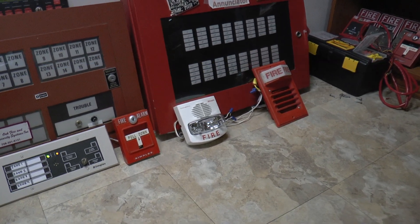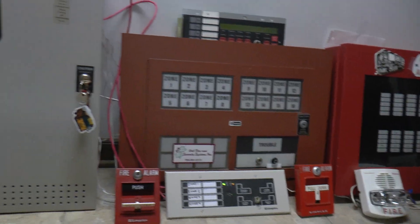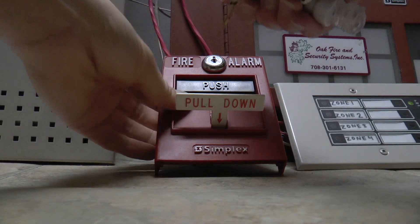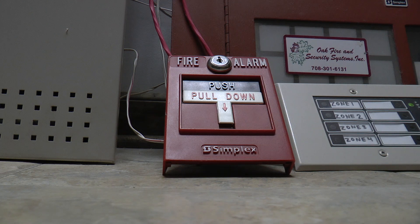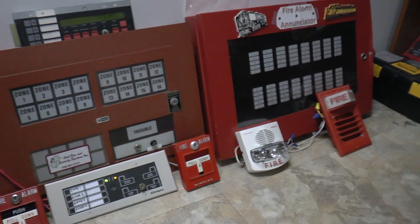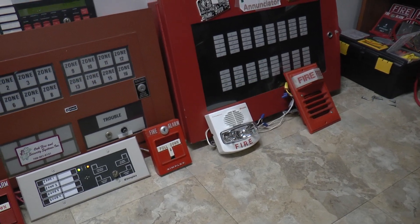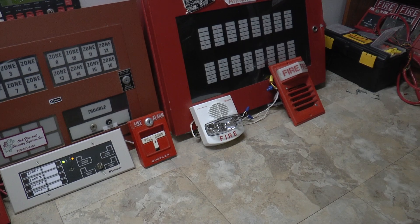It's on 75 candela. I had left it on 15, but now it's on 75 — holy cow, does that make a difference. That thing is much brighter. Let's reset the pull station. I'm going to put the camera down and reset the pull station. While I do that, I'm going to put on hearing protection, because the 9806 is a very loud alarm. I'm going to reset the 4010 — system reset in progress. Let's let that reset.